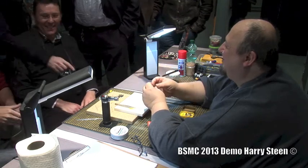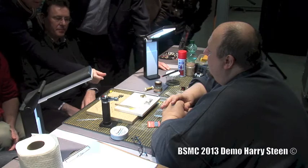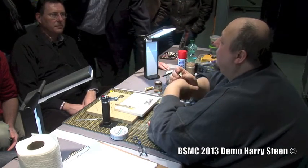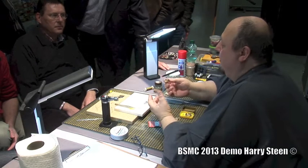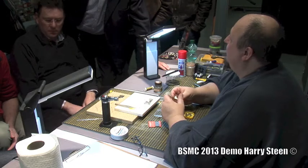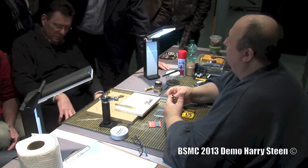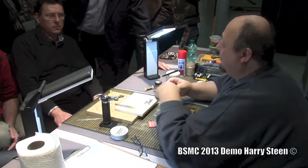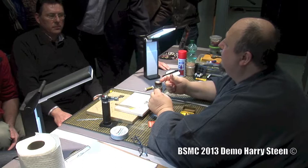Any more questions? If you have to solder a longer length, do you use that full length of solder or just two or three small spots? In this case it's actually two corners only. If I have a longer part, I would try to go in one go. I would maybe start in the middle so the heat spreads to both sides. If that's not working, I would solder as far as it goes, then clean the part, put a wet cloth or clamps to keep it closed so when I put heat again it won't open up, and then solder the rest.